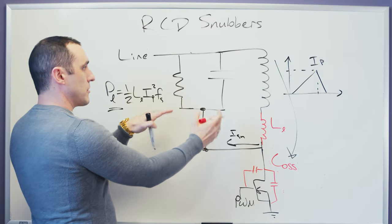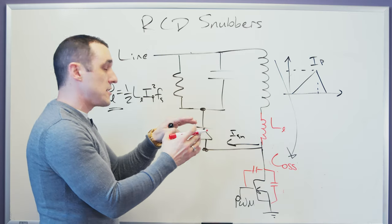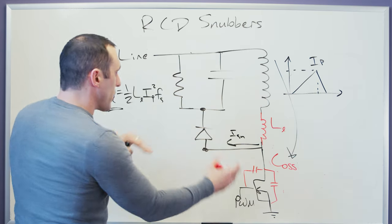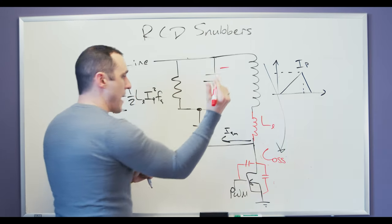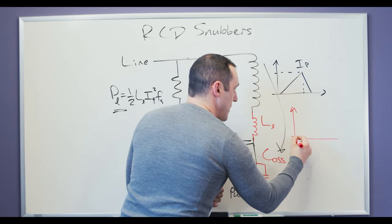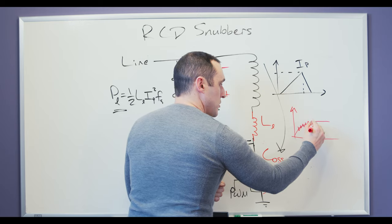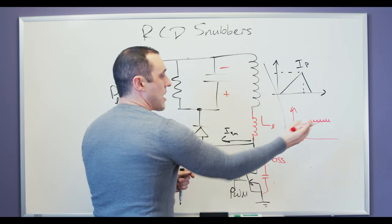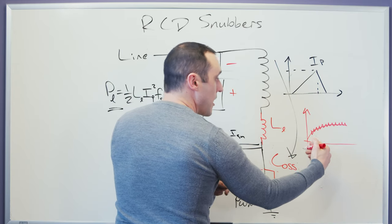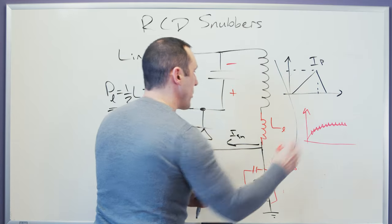What is the role of these two circuit elements in this snubber circuit? First, we have a capacitor — the role of this capacitor is to essentially just charge up and hold as stable a voltage as possible during these events. So if we measure the voltage across this capacitor, during the transient event it rises up and eventually reaches some value. There's going to be some ripple associated with this switching action superimposed on top of this capacitor. In stable operation you basically have an average rising waveform, and then you have the switching waveform associated with the PWM signal superimposed on top of this.